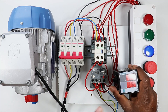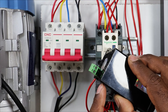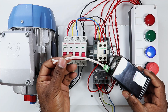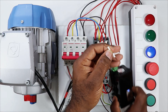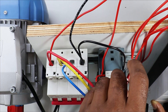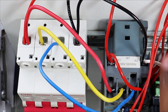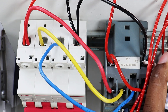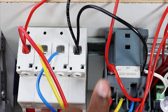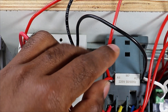What you have to do is simply: there are two terminals behind it, as you can see. You have to connect two wires with these two terminals. After connecting these two wires, we have to connect one wire with the neutral power supply. In this way we connect one wire with the A2 terminal. Now the second wire we have to connect with the phase supply, at the A1 terminal of this contactor. But here we can see that on the A1 terminal, already two wires are connected.